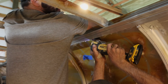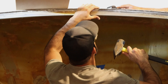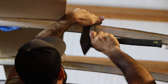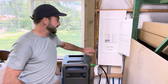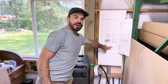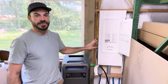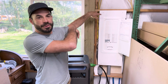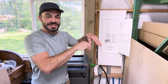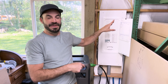I really like this system because if you're a business owner and you're looking for a quick, inexpensive way to make sure that you have power when you need it, the generator interlock kit is definitely the way to go. It's a simple bracket that bolts on here and it makes it so that your main breaker can't be in the on position when the breaker that brings in the power from your F3800 is also in the on position. We don't want to be sending power back to the grid. We want to be using that power here where we need it most and keeping the people trying to work on the grid safe from electrical shocks that might reach them.